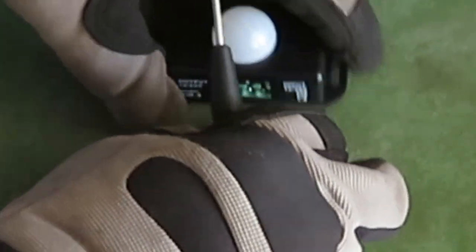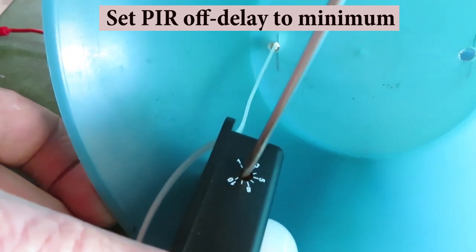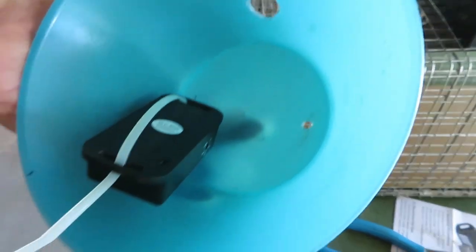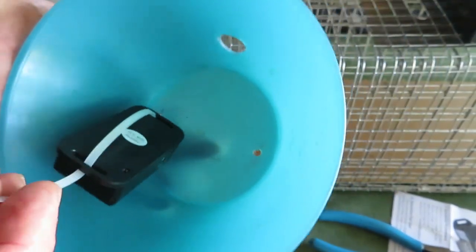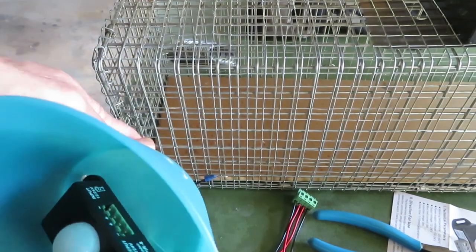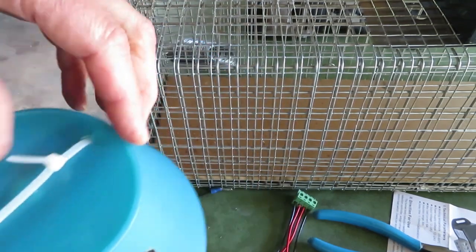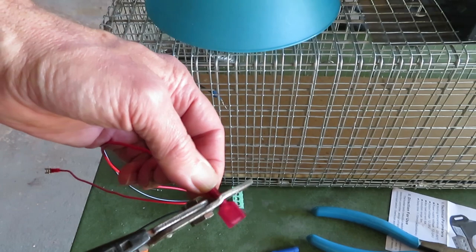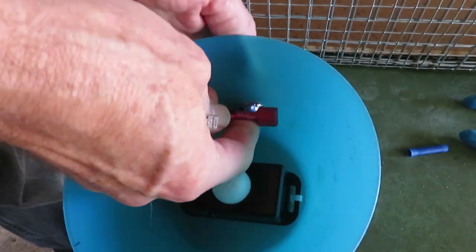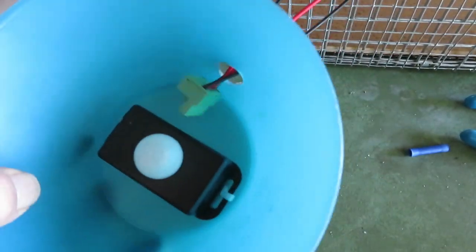This sensor was designed for LED lighting and it has an off delay on it — we don't need that, so we're setting it down to the minimum of one minute. Just using a wire tie to attach this to the underside of the bowl — I'm going to call it the sensing bowl. I'm crimping on some insulated fittings on the output side. The wires have to feed through the hole we put in the sensing bowl, and then when we're done feeding it through, we'll plug it in.